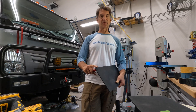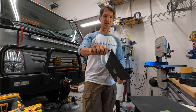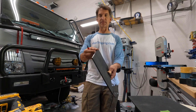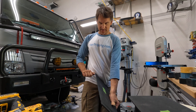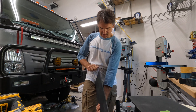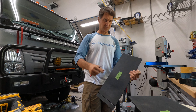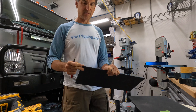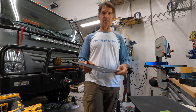Now let's give these a nice round-over before I bend them, because it'll obviously be harder to do this after bending. This is just to smooth out these edges — just like that, give a nice smoothness. It'll help keep these edges from being as sharp. Just a little deburring bit, that's all this is. Feel the edges, feel for any roughness — they all feel great. Now we're ready to go and do our bending.